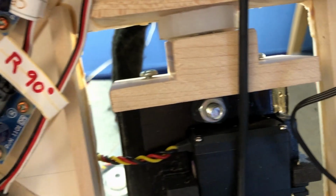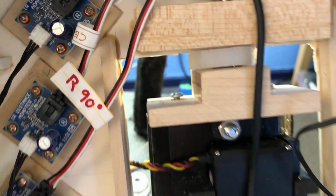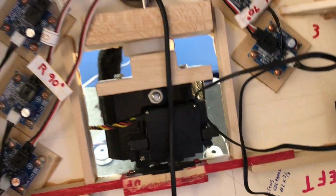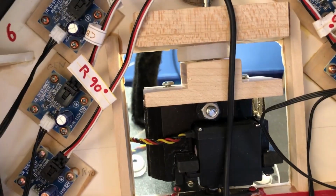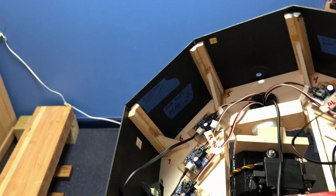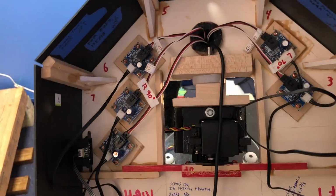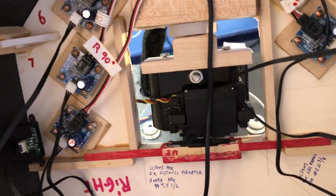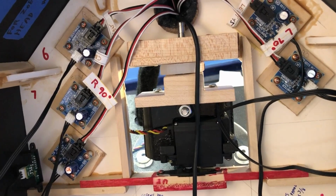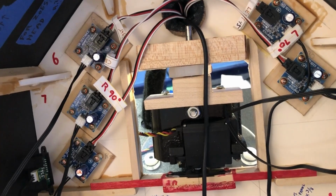Now this piece here, I know it looks horrible, big and bulky and wood. That's the wobble. That's so that the servo can turn the head this way and that way. And that whole process, if you're looking through the camera, really makes the picture look bad. But what that's for is to tilt the head to show that the robot is confused about something.